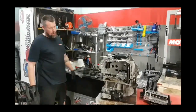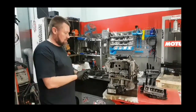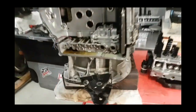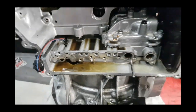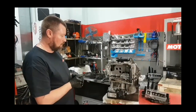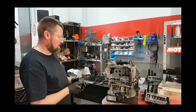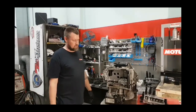So what we're going to have to do now is pull this gearbox apart and repair the shift forks. As you can see with this gearbox, regular oil services weren't done. They're a dark brown colour and it's also seen a lot of heat. This oil is a light green colour normally and that's definitely not the case here, so it hasn't had its main service intervals to prolong this gearbox's life.